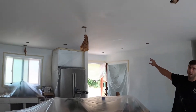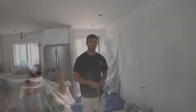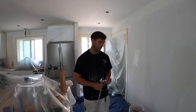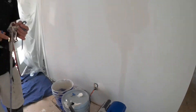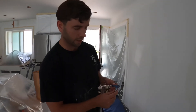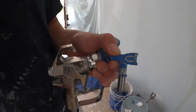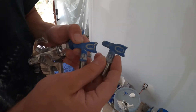Now we also have a bunch of drywall patches in the ceiling. So after everything's masked off, first thing we're going to do is just prime our patches. So depending on what type of sprayer you're using — I'm using a Graco Ultramax 490 — you're going to want to choose different tips. The tips have numbers on them. This one's a 517, so for little drywall patches I'm going to use a smaller 411.